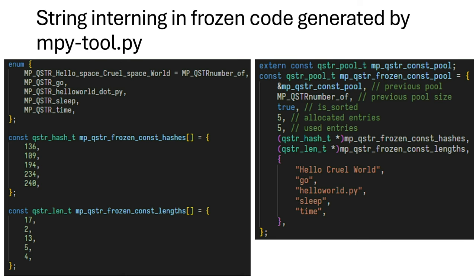But if you're like me, you make your own fun. You don't really follow the rules on the CTF. You'd rather just play around with it and not even score any points. This is fun for that. It's only as well protected as access to your firmware. So if you can dump from flash, if you can dump from the REPL, if you can grab over-the-air updates for things, you can get at this stuff. So it's not a layer of protection. And you could probably automate this extraction process, but it's a bit tricky to figure out the links of some of those data structures too.